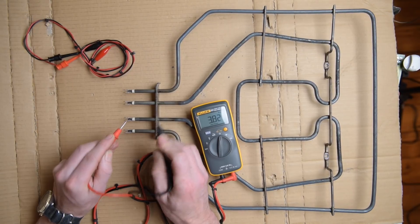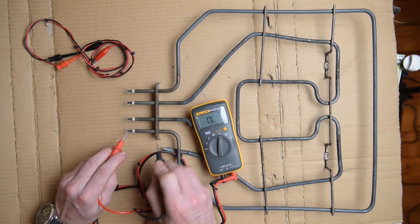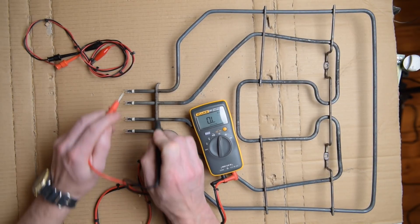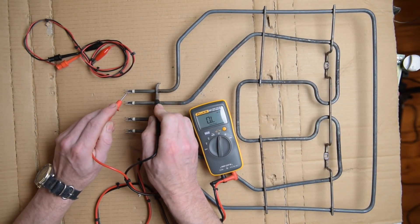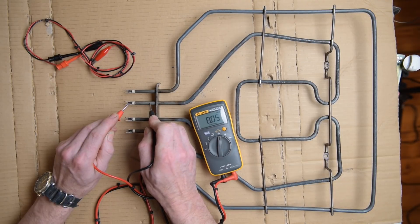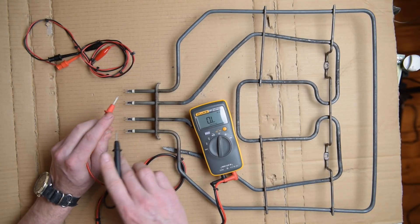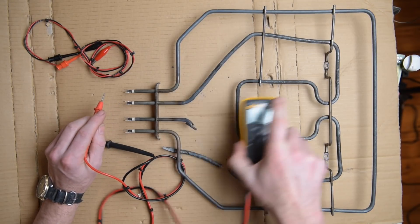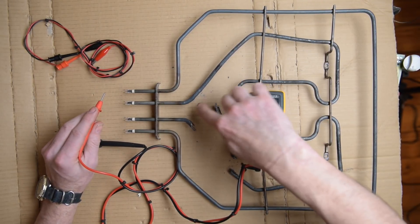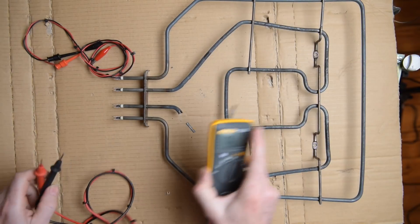That just goes to show you that there's a leak somehow between this core and this point here. Let's try the other side — there's another leak. Now what do you think? If you go from there — nothing. That proves to you that this one is completely shielded. This one here — same thing, nothing. But this one — there you go, you've got a resistance. So it's leaking through the core. That's what the issue was. Even though you've got a break on it and it should be open line, it's still creeping through and going to this shield.